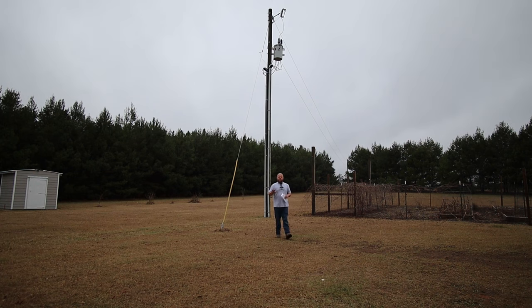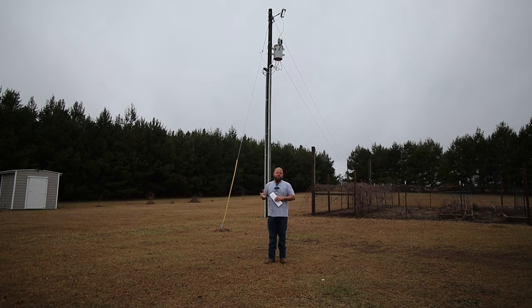The next thing to look into is power. Can you get power running? Is power available, and how are you going to get temporary power to build your house? Depending on your local power company, ours will actually run power to your property for free if you have building plans showing you're in the process. Regardless, you'll go to your building department and get a temporary power permit — whether for an RV, agricultural property, or house construction. Work with your local electric co-op to get power on the property before you start building.